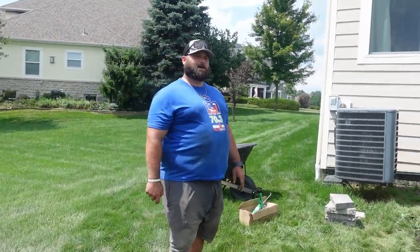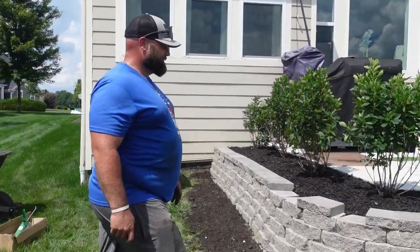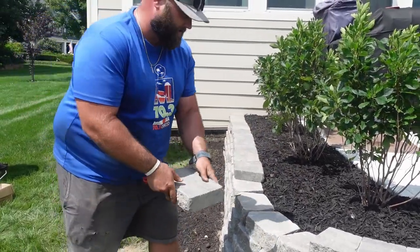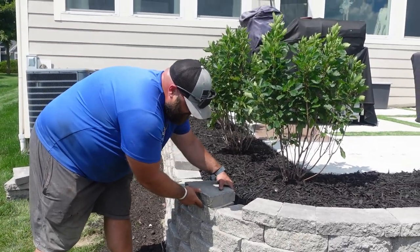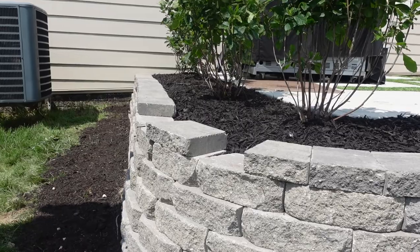We're just cutting the capstone basically around the corners. They don't fit perfectly, so they pretty much have just an angle right here, and every single one has the exact same angle. Just depending on the radius of the curve it might be different. What you have to do is line two of them up next to each other, make sure it's lined up with the edge, and then go grab another one.